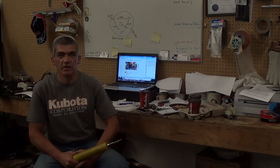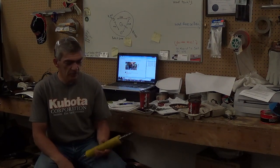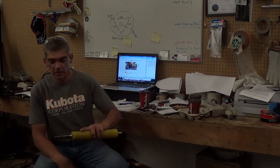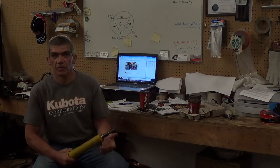So this is what showed up. If I remember, it's a Makita planer, and the bearing had worn the drive end of the shaft, and he asked us to do a repair on it, so I think he wants the video as well. So far, we did our TIG weld on yesterday, and we're waiting on him to bring in the bearing right now, and we'll get the job finished.